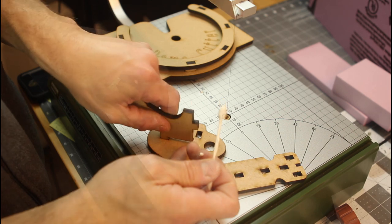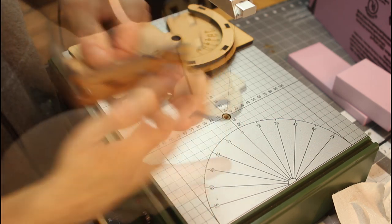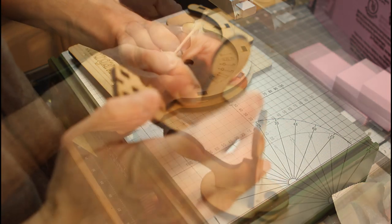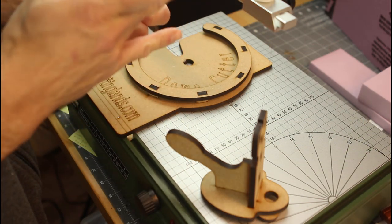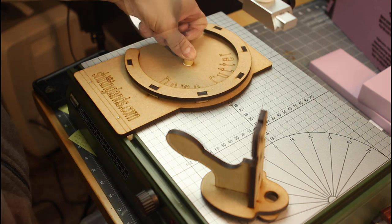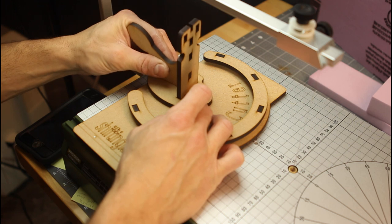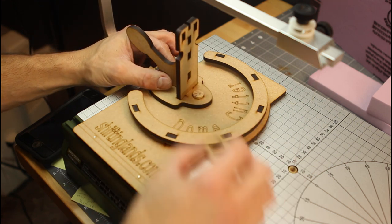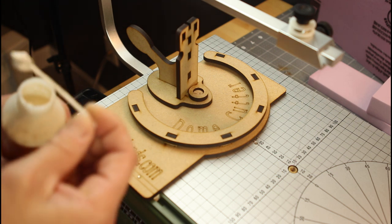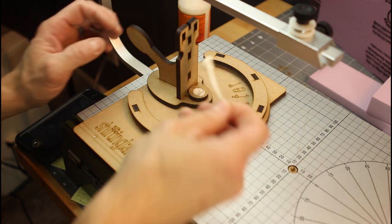Now you're going to work on the rotation section of the jig. This is going to fit underneath the ring section that we just lightly hammered into place. I like to go ahead and clean up all the wood glue off of those seams. Now we're going to glue the cylinder into the base plate — just a little bit around the perimeter — and push it into place. Make sure that it's vertical. Then slide the rotation section of the jig on top of that cylinder, and place this little ring on top of that. Be careful to only get glue on top of that little cavity; you don't want to glue the rotation section because you want it to be able to spin freely.